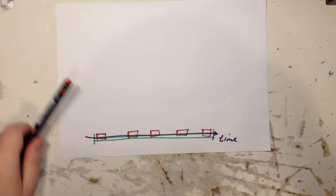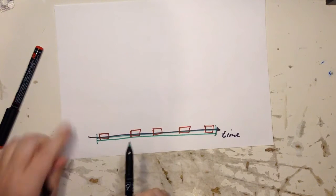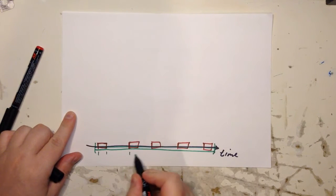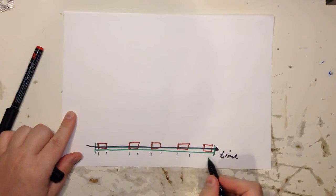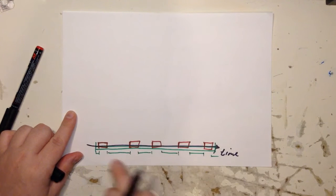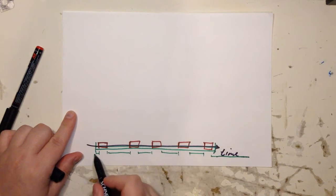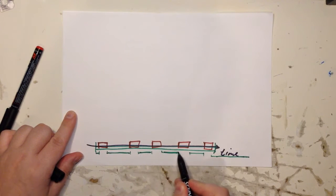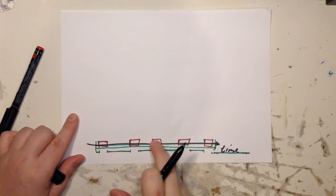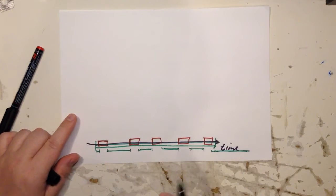So the function that you were calculating here is no longer calculating inside this interrupt routine because the processor is busy. So you have your calculation going here, and all of this will be added up to your delay, your latency, or what you call it. All of these times you have spent in the interrupt will make your function take longer.